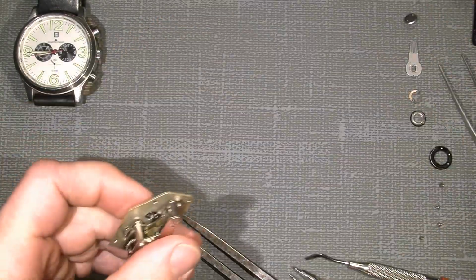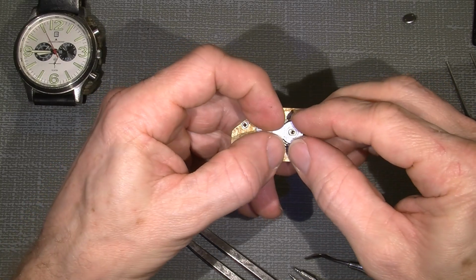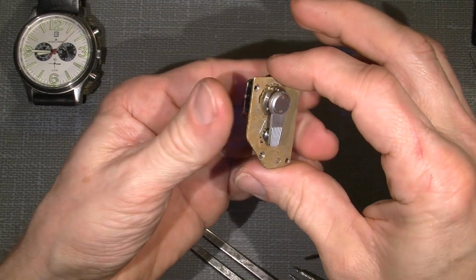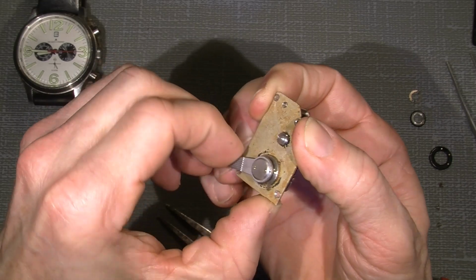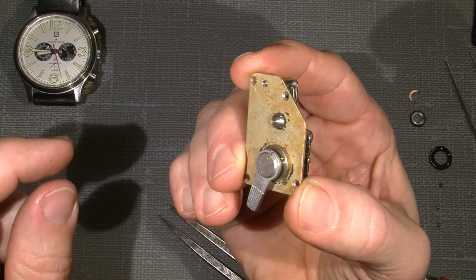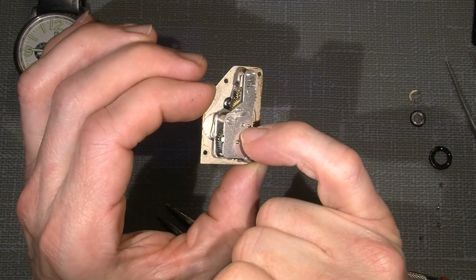But in this case, maybe it's the same for others, well, it's an old camera. We'll see what's happened. So I put the lever on so I can activate the self-timer mechanism. Not necessary to screw it fully tight, but this is how it works. I cocked the self-timer like this, so it's ready, and when I push the button here, it goes on like this. When it's almost done, it will activate this pin and push on the shutter mechanism.